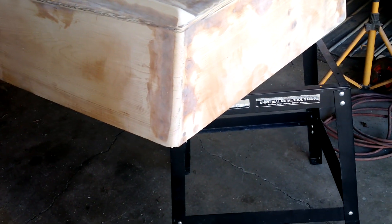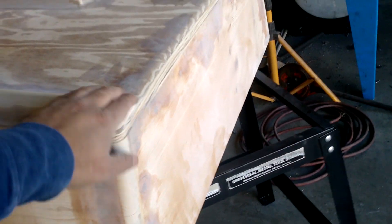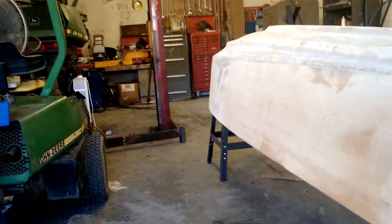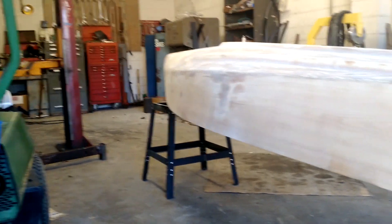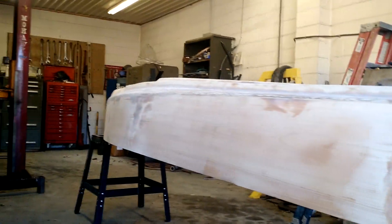The parts you haven't seen before is the work that I did on the transom. Here you can see everything is nicely rounded over — all ready and rounded and trued up, nice and smooth. You can see the fillets — the glass should lay in there very, very nicely. You can see the radius along the edge. If you look at the angle, remember that's a 1 by 12 — you can see how it's an angle. You can follow the angle of the side and see how the side of the boat was actually bent and twisted, and as we get to the front, you can see it's completely vertical. It also introduced rocker. If you look at the chine line, you can see that the chine is higher in the middle than it is on the ends, so that twist actually introduced a nice rocker to it. I am really very excited about getting this thing in the water.